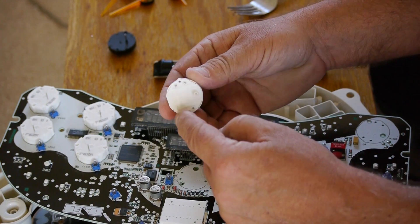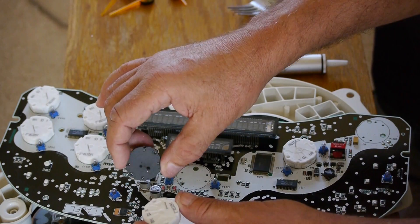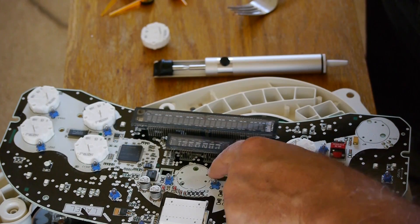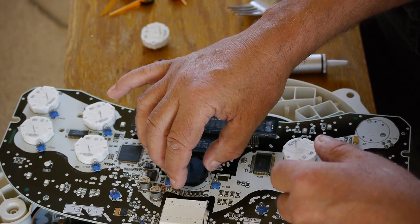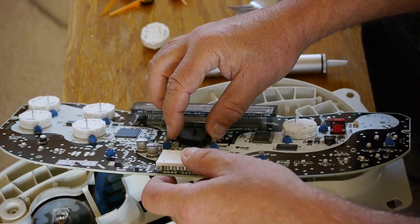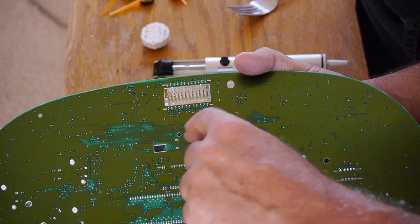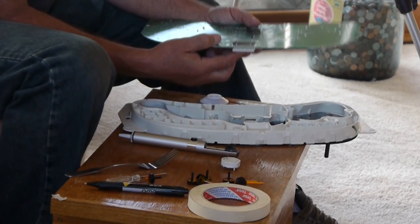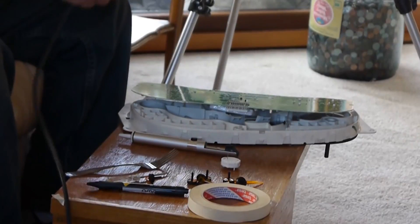Here are the pins that you solder — these are the alignment pins to put it into the right spot. We're going to go ahead and replace this one. Be sure that the pins are straight and that you get those back into the spots. I can feel all four pins have come through to the foil, and I want to be sure they don't shift. Roll it over so the foam holds it in place.